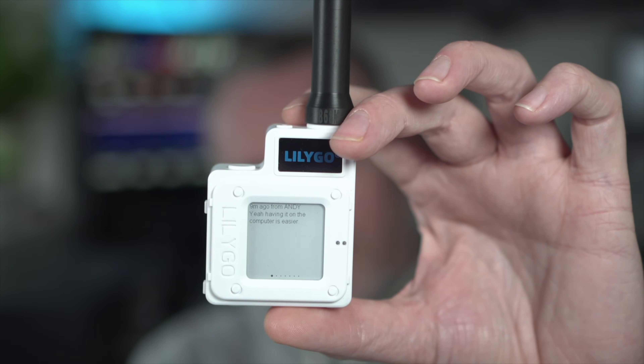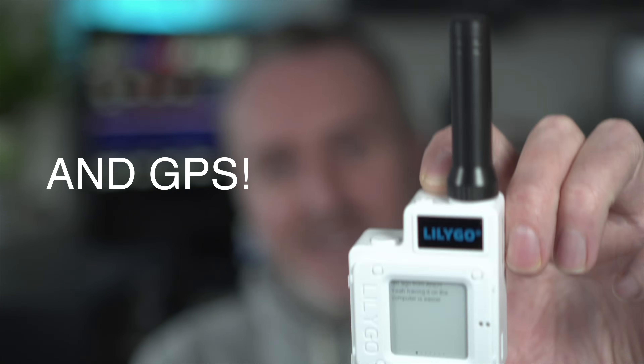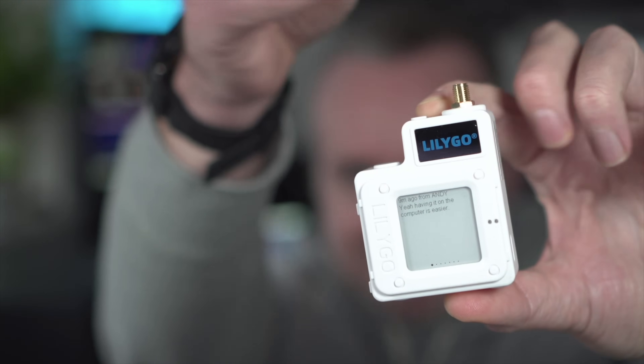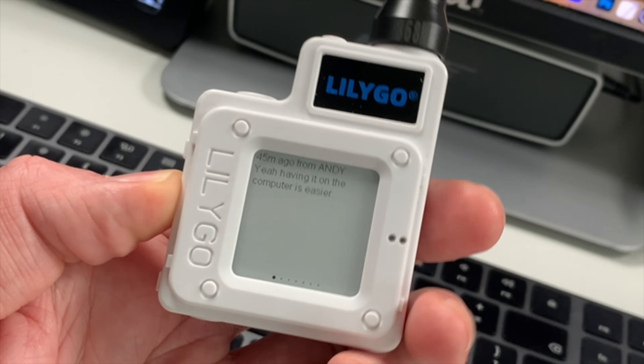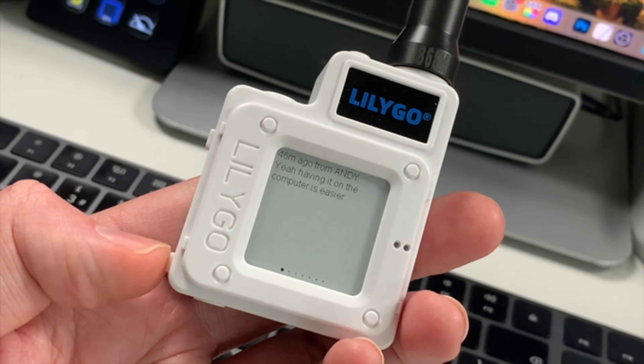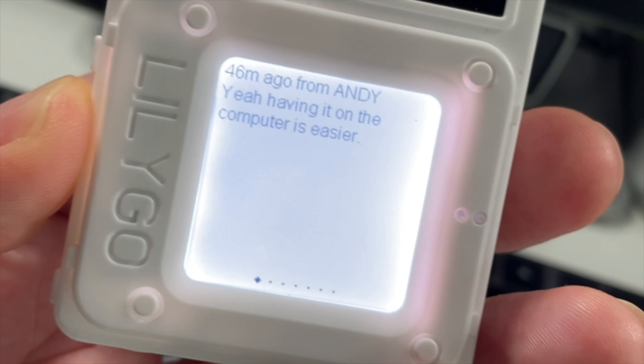There's also a link below for another device I really like at the moment which runs Meshtastic — the LilyGo T-Echo. These are absolutely brilliant: they've got a battery built in, an SMA antenna socket on top for external antennas, and an updated chipset. Power consumption is about a third of the Heltec, which is really good for remote deployments. They've also got a really cool e-ink display, a capacitive button to refresh the screen, and even a backlight that doubles as a torch.